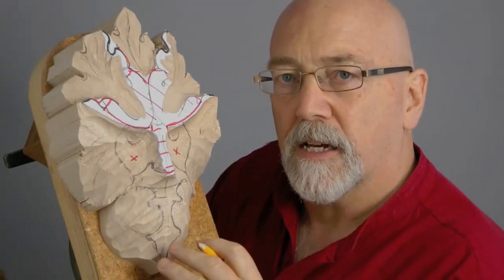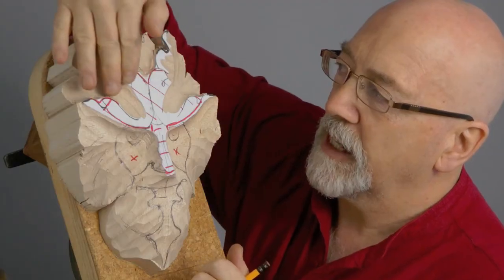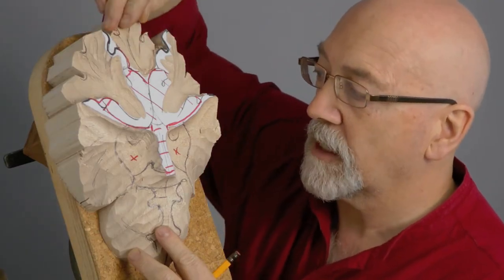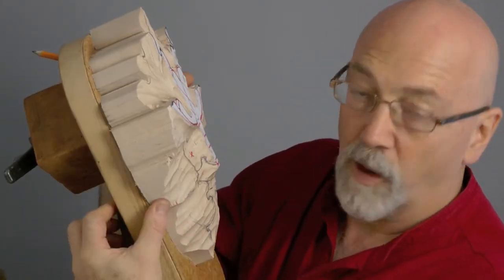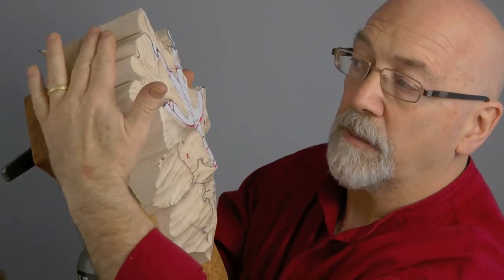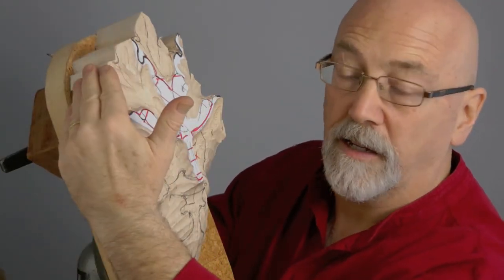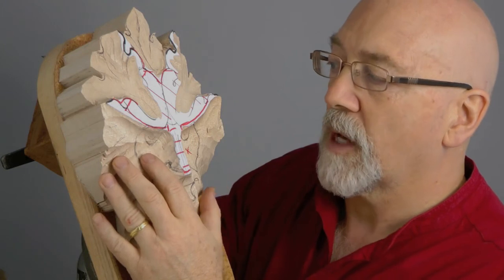Okay, so I want you to get the carving to this stage. You can see that I've taken this leaf back and given it a bit of a twist, and the same with this one, and then this one's set back in. So it's a little bit, but again it's got a little twist, and I have redrawn various points. If you look at the side view here, you can see I've come quite far down to the back here, but not so far down here, because this needs to be quite undercut, so that the whole carving is angled like this. So it's sort of cone shaped really. This is the furthest part down the bottom, this is the highest. So don't take too much wood away from here. And these pencil lines, they're just guidelines at the end of the day. We can alter these as we go along, depending on what we find.